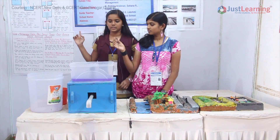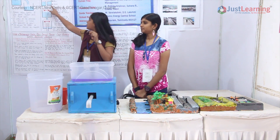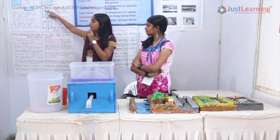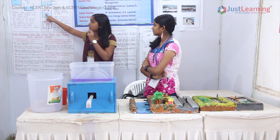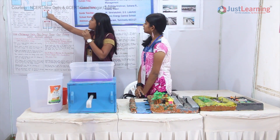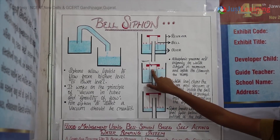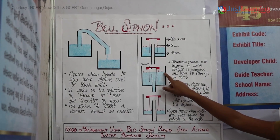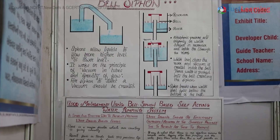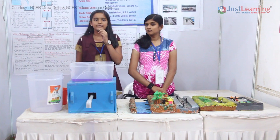I will explain the working principle. Initially when the water is filled, atmospheric pressure acts on the surface of the water. When the water level rises and it closes the mouth of the pipe, the region inside the bell becomes isolated from the atmosphere. So when the water flows down due to gravity, the region inside the bell becomes vacuum. Thus the atmospheric pressure pushes the water into the bell and the water flows down due to gravity. Thus the siphon gets started without any external energy.